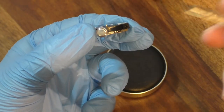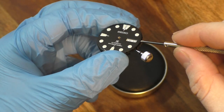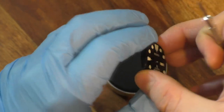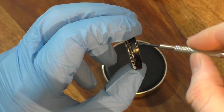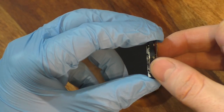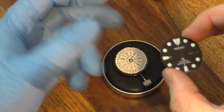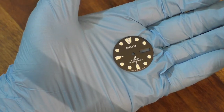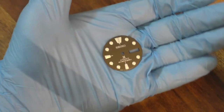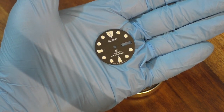With my trusty screwdriver in hand, all you want to do is find this little groove under the dial in the movement holder, twist it around, and directly across from it you'll find another one — just put it in, turn it, and the dial comes off the movement holder quite easily, just like that. Try to refrain from touching the main centre of the dial so you don't get oily finger marks on it. I do have my main working hand gloved. And there's one pristine Seiko Turtle dial right there.